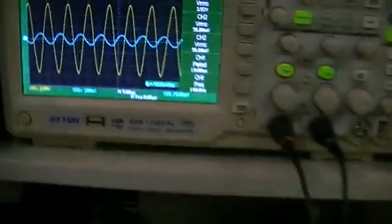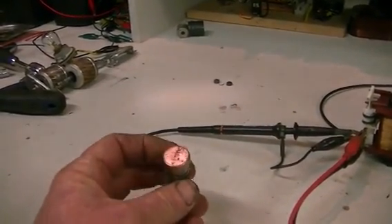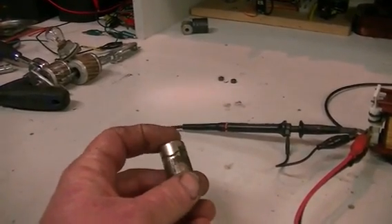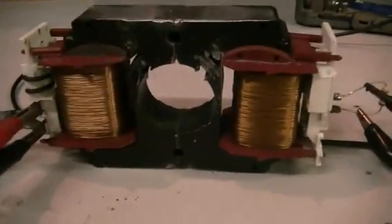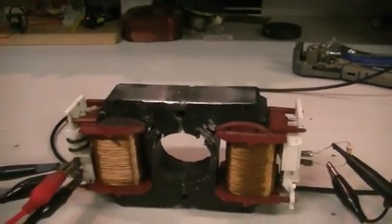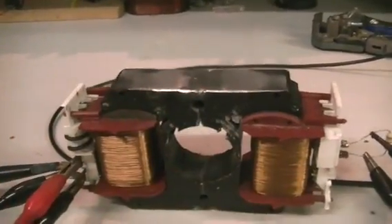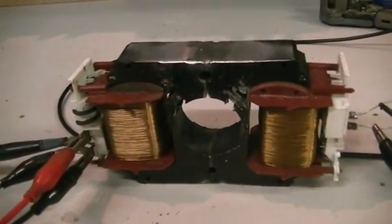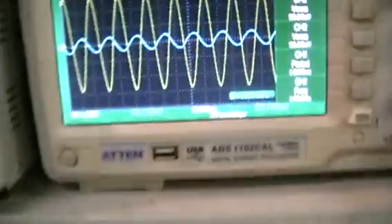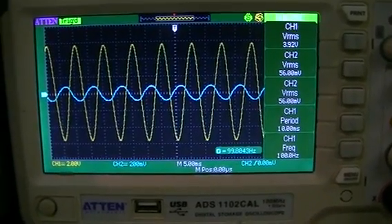What I found was, if I take this extremely strong neodymium magnet — it is an N52, 3 quarter inch by 1 inch — and I place it inside our hole there, my initial thoughts would be that being the strong magnet that it is, the core would become somewhat saturated, or we would see a very large offset on the AC waveform on the secondary, whereas that magnet would bias the secondary coil.